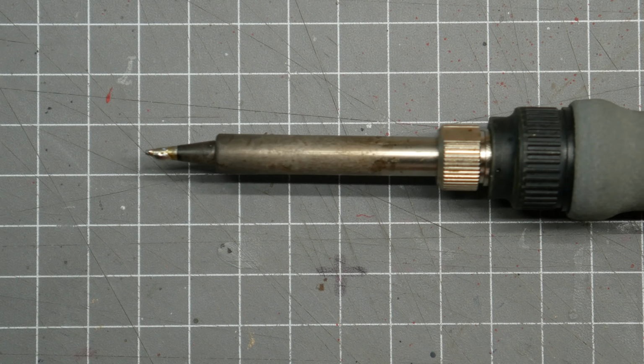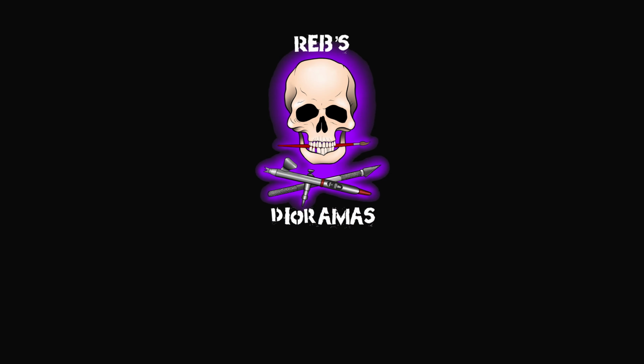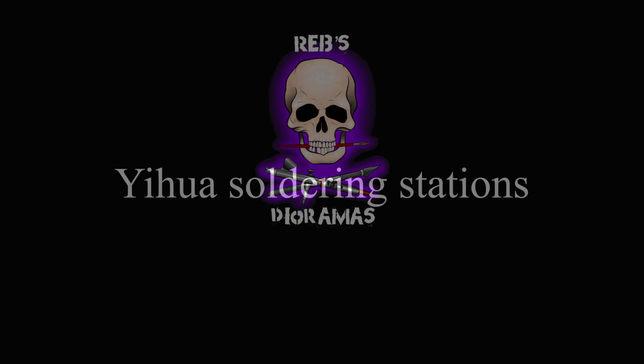Some other irons get an honourable mention. I haven't personally used them, but I've heard good things about them. The TS80 and TS80P are meant to be the updated versions of the TS100. They both have USB-C for power and firmware, both use Quick Charge 3 standard, which means they need a Quick Charge 3 compatible power supply to deliver the 9V 2A they need. The TS80P can also use the USB Power Delivery 2 standard, which is 12V 3A. Because these are USB powered irons, they suffer from the same issue as a cheap USB iron. Using mains to USB plugs means the tips pass current, which can damage components. Miniware thought of this though, and it does have an earth connector, but you need something earth to connect it to.